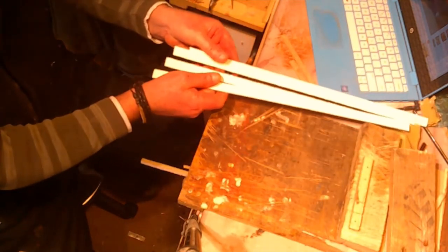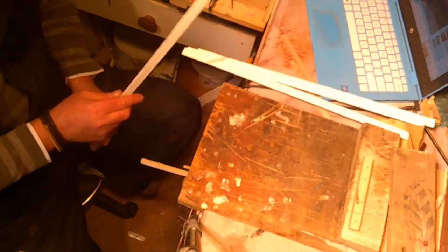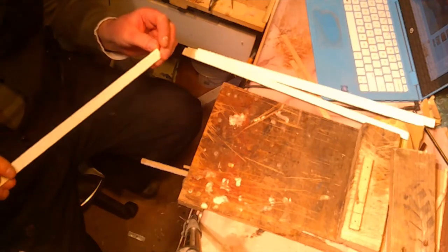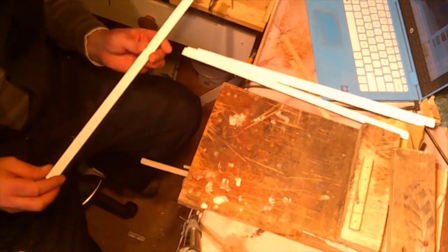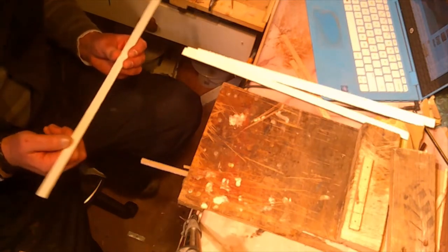Now, moving on to the shingles. I've already painted all the backs of them, as you can see. That's because I'm going to do it different this time. I'm going to put them directly onto the rafters at the rear of the building. So obviously it's going to be a pain to paint them beforehand. Now I know there'll be a difficulty with gluing them, but I'll be using glue and dowels. Because of the paint, the glue won't take very well.